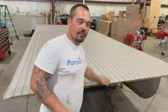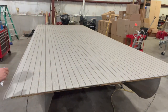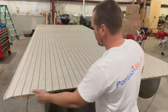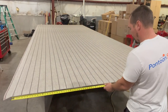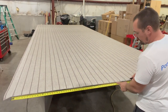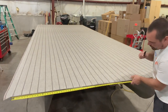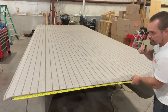I've cut it pretty much flush on the front — maybe leaving a half inch to quarter inch of overhang. We'll do the same on the back. I've got a square cut. Now I'm going to take a tape measure and measure out to roughly halfway. Halfway would be right here at about 47 inches, so I'm going to make a mark on my plywood at 47 inches.